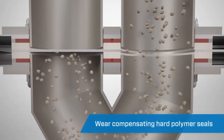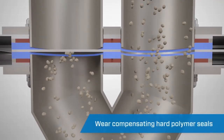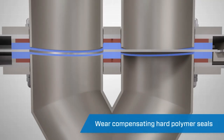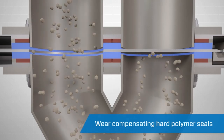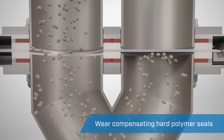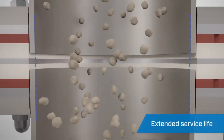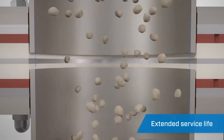One of the main features of the Y-Line Diverter is its wear-compensating hard polymer seals, which provide a positive shutoff through the closed port. Ordinary flapper-style diverter valves rely on elastic seals which are exposed to the material flow stream, causing them to erode and tear away in service. The Y-Line Diverter is designed so the seal plates are shielded from material flow, providing long, reliable service.